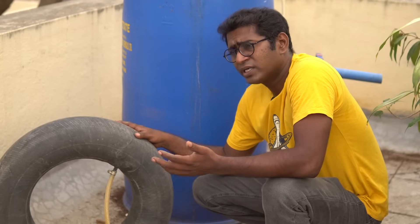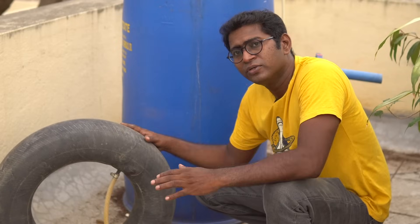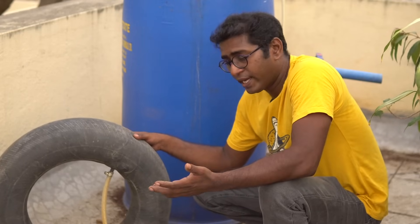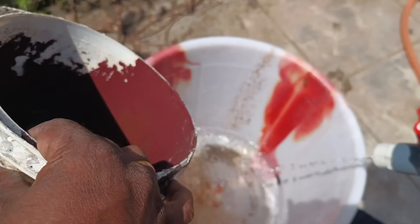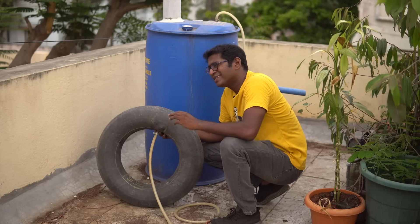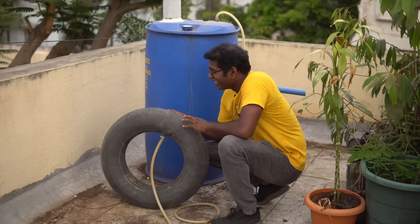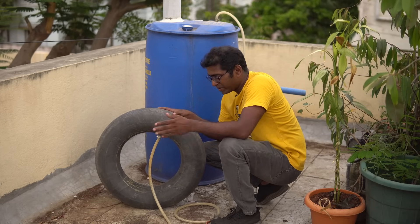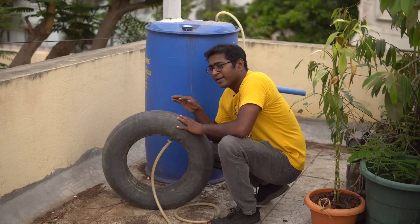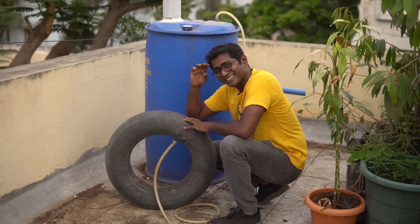To cook for 30 minutes you'd need about six or seven full tubes, and each takes a couple of days or more to fill. So with a setup like this, you may not be able to go completely off the grid — you can partly reduce cooking gas costs. The slurry from the overflow pipe can be used as liquid fertilizer by mixing it with water in a 1:10 ratio. To make this practically usable, I'd need to increase the reservoir size, add a flashback arrestor, and feed the digester regularly. It works — but those are the improvements needed.